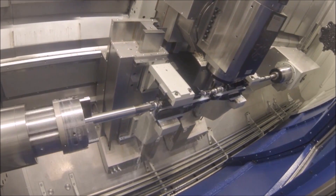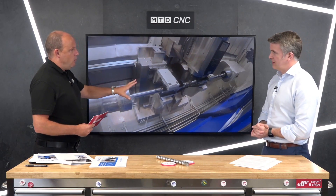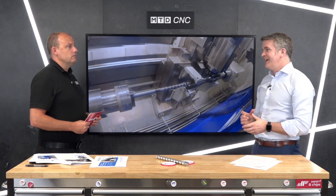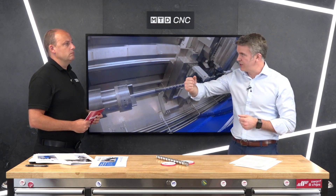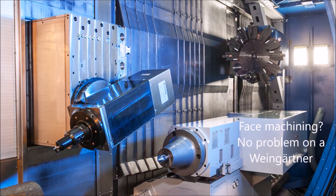We're talking essentially about multitasking technology — dual spindles if necessary, milling heads — but it goes beyond that. There are a lot of machines of this style in the marketplace, so what makes these different? The first main thing is we're not talking about a slant bed machine with a fork-style five-axis head. We're talking about a combined machine: a horizontal borer with a traveling column and a swiveling B-axis coming off a ram. That's the concept behind the MPMC range — really versatile and really modular.